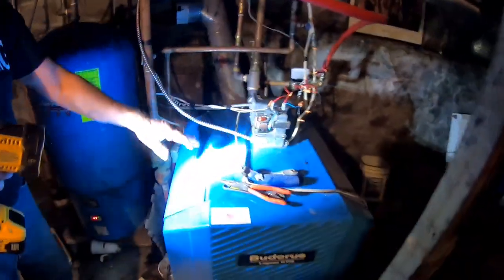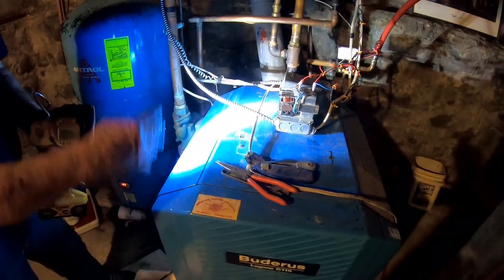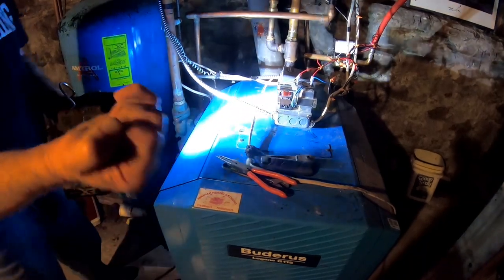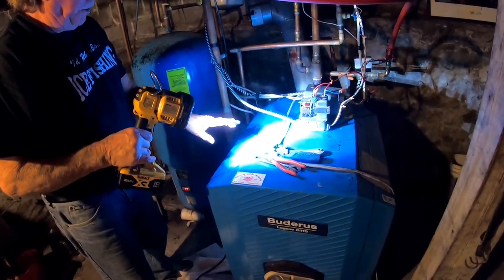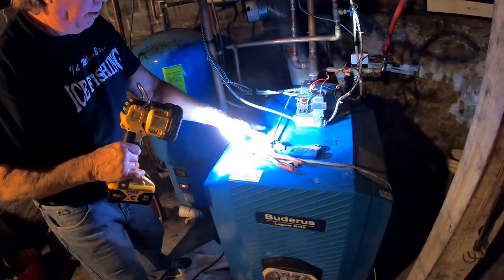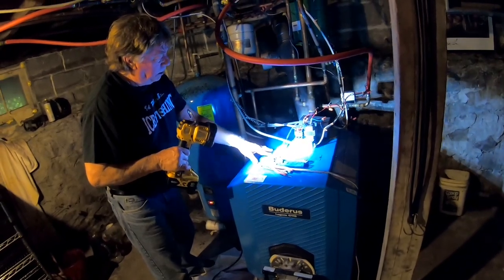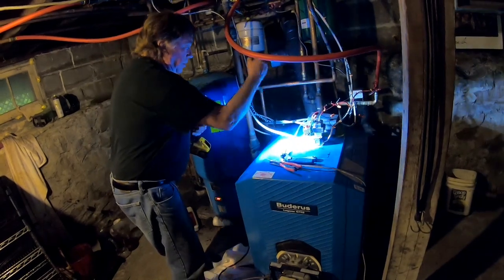You've got to be able to get to the boiler sections. Right now you've got to get a wire brush and get all that soot out between them — it's a dirty job. The inside is all carboned up because the air mixture wasn't right. This has to be taken apart and cleaned between the boiler sections with a brush.